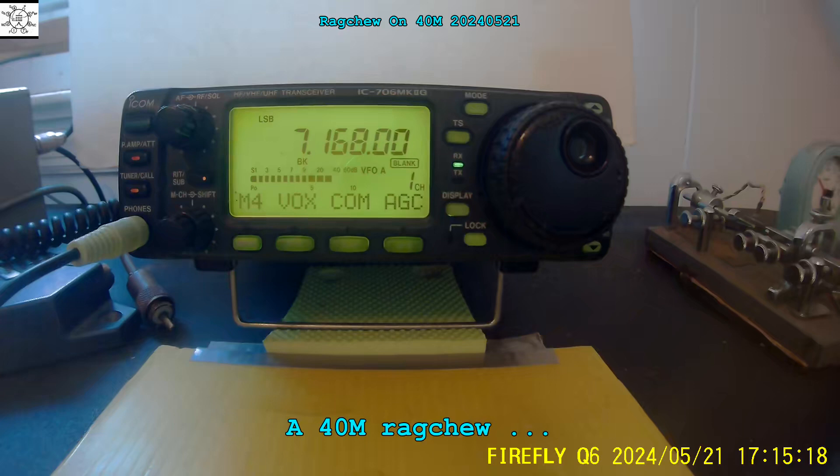That signal has got to be coming in somewhere — I thought I had it trapped but I didn't. Still more work to come. In your situation, because it's so light, I don't suspect the antenna. Usually when it was like this with me it had to do with the powering of it. I take alligator jumpers — two feet long with a big alligator clip on each end — and I jumper chassis to chassis one at a time, trying to find the path.